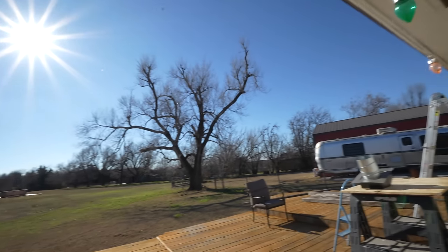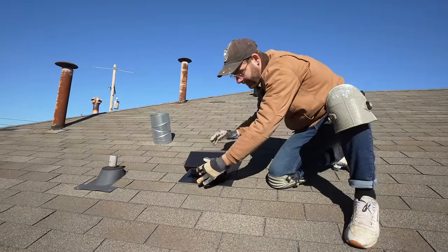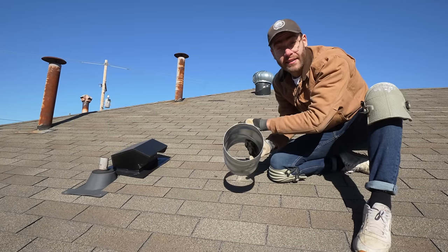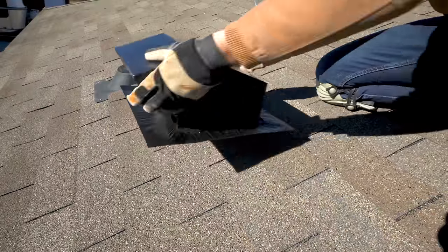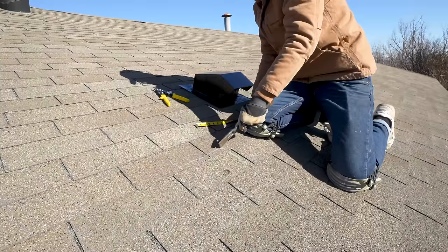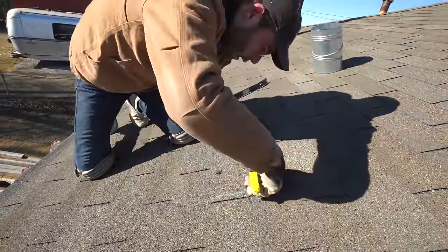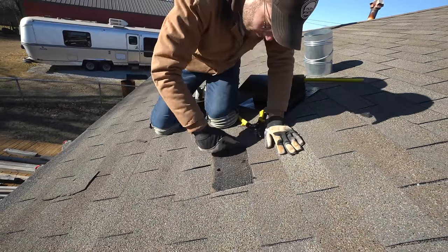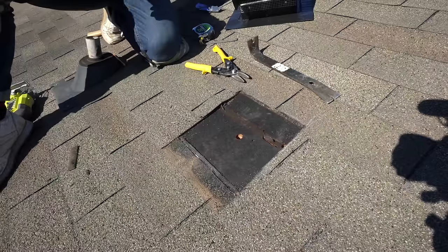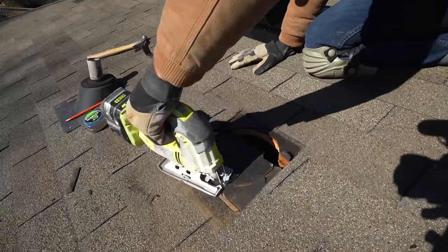It was a pretty nice day outside and I was happy to have sunshine in December. Up on the roof I can see the pilot hole through the shingles. The vent hood is gonna sit right over the center of that on the edge of the shingle. The hole we cut needs to fit the elbow piece that connects the hood to the rest of the ducting. Using the pilot hole as a reference point, I lay out a square the same size as the vent hood — just the part sticking out, not the larger flashing area. I used a pry bar to get underneath each shingle without damaging them, yellow tin snips to cut away the shingles one layer at a time, and a sharp utility knife. The vent flashing sits on top of the last layer of shingles, so I'm only cutting away the section the hood pops through. I used the ducting elbow to mark the radius and made the cut with a jigsaw.